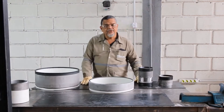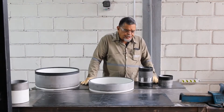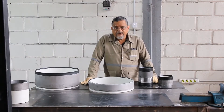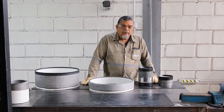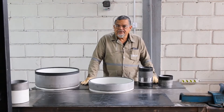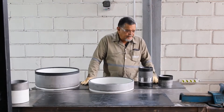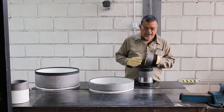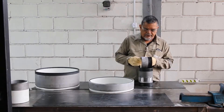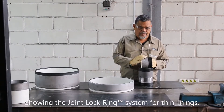But this was not enough — it wasn't the most obvious challenge. It wasn't enough because we also needed to make sure that after we weld, we had the parent metal of the pipe completely sealed from the liquid that was being transported by the pipeline. We had to develop sealing systems to achieve that task. We came out with a ring to be inserted into each one of the pipes to be welded.